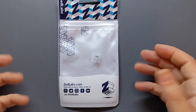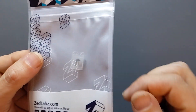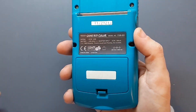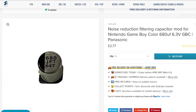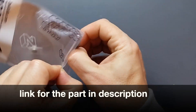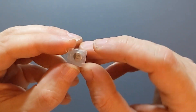This sort of process is what's known as a recap — cap being short for capacitor — replacing one of the ones inside this Game Boy Color. So what we'll need to do is open up the console, remove the existing capacitor and replace it with the new one. I bought this one from Zed Labs and as always it comes in these nice little packages that I struggle to open, so I need to find some scissors. And here we are — two little tiny connectors and the capacitor itself.